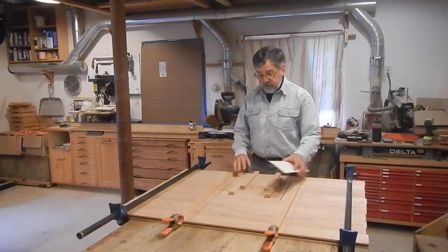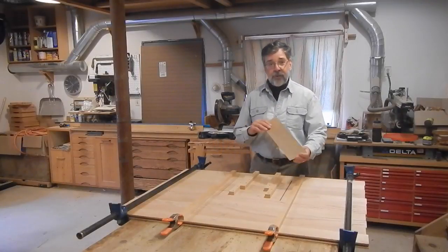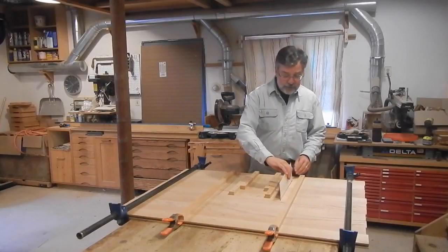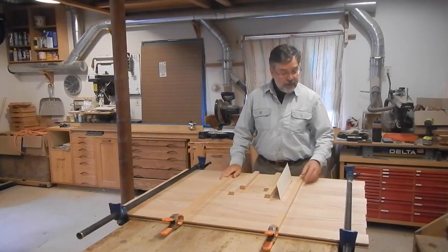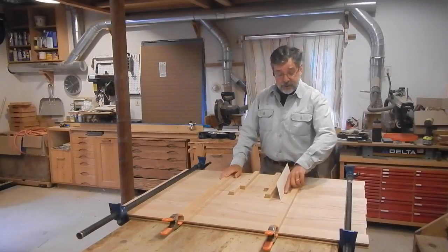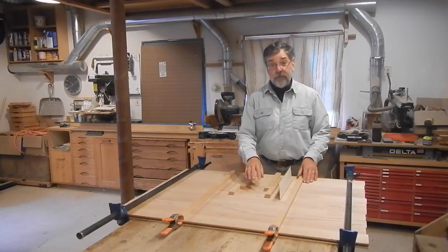So with the bilge access panel clamped firmly in place, what we'll do now is take a scrap piece of countertop laminate, like Formica, which is about 1/16 of an inch thick, and we'll insert it into the gap along the side of the panel, and then we'll slide all the side boards up against it, which will hopefully give us a nice straight edge along the side of the opening, and will provide a suitable gap space between the main floor and the access panel.